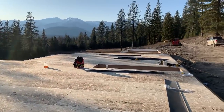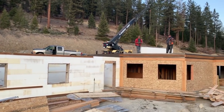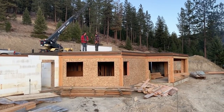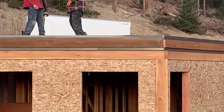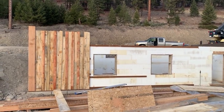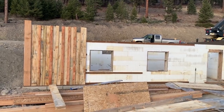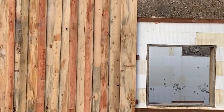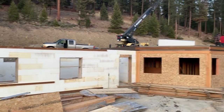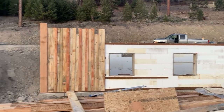This is the end of the day. Isaac, Tyler, and I got the metal put around the whole perimeter of the house, the subfloor and porch pressure treat done, and we got that far on the board and batten. We put pressure-treated two-by-fours on the styrofoam, fastened them with screws, then put the board and batten on. That's going to be a nice cover for the front of the greenhouse. We might carry that same board and batten along the basement walls too. Pretty good day.